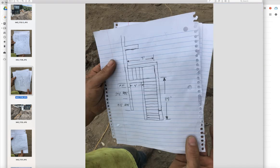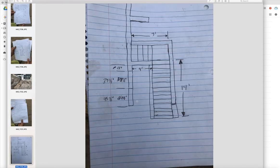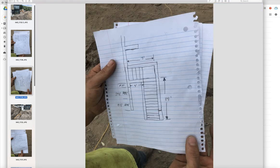Okay, so that's the scissor stair — that's what we're going for on that side. Then on the other side, we have another staircase. This is four foot wide. This is existing foundation, and the garage is right here. So we're going to stone all this, and then there's a gas meter out here, so we'll just stone all that and build a retaining wall. We have 14 steps, and then a platform, and then four more steps, and then you step onto the guest master suite — that's the patio up there.